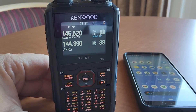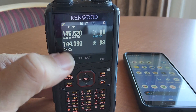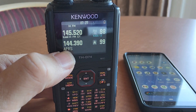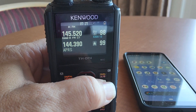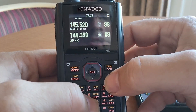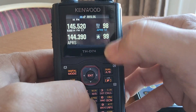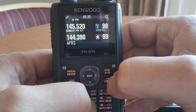Just to get it started, make sure you're on an APRS frequency. I've got 144.390 in my lower band on the B VFO here. To enable the TNC, press the Function key, then press the APRS button — that's the 5 key, Function 5 — a couple of times. It'll first say APRS 12, that's one mode. Press Function 5 again and see how it says KISS 12.